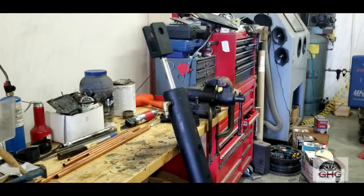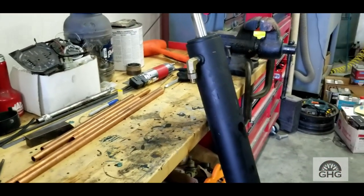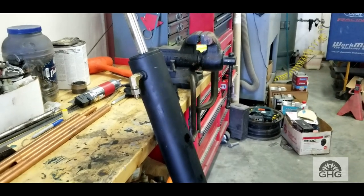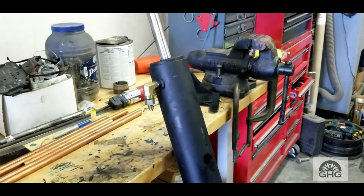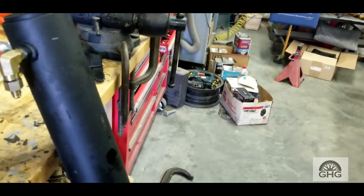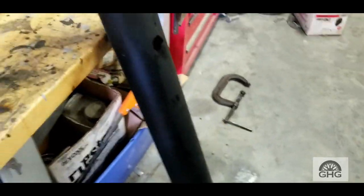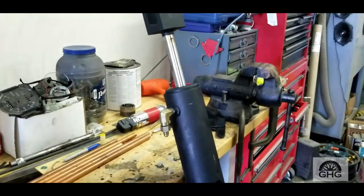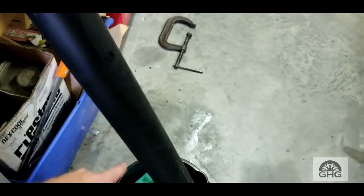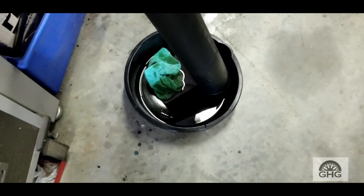There's the cylinder removed. This is a single-action cylinder — it's got one hydraulic line connection and it pushes the cylinder only one way, then allows gravity and weight to extend it back. Pressure comes in, pushes down on a piston, forces the cylinder toward the bottom. The problem is it's bypassing the seal — instead of pressure staying between here and the seal, it's going past the seal and right out to the bottom.